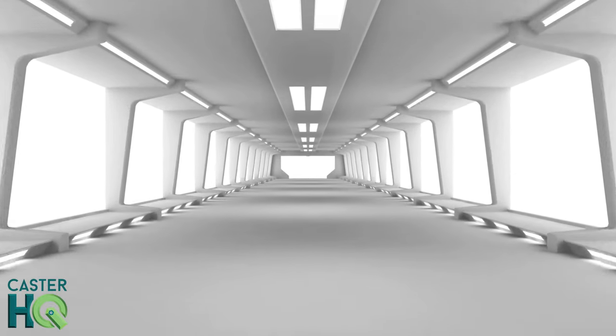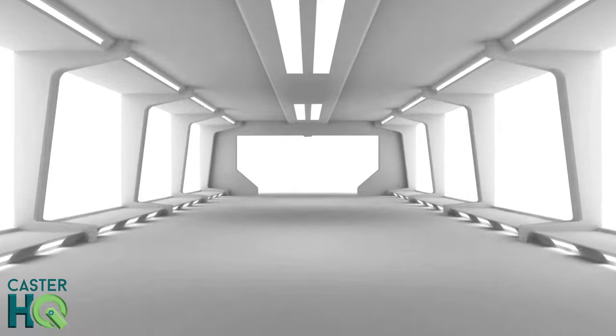Once you figure out the environment, you want to look at maneuverability. Do you need four casters? Are you in a tight space without a lot of room? Then I would recommend four swivel casters. If you have a long distance to roll your cart — say a straight-line application going back and forth 10, 20, 50, or 100 yards day to day — I would always opt for two swivel and two fixed rigid casters. The rigid casters allow you to roll in a straight line. With all swivel casters over long distances, the cart gets wobbly and hard to control. For short distances and tight quarters, go with all swivels; for medium to long distances, go with two swivel and two fixed.